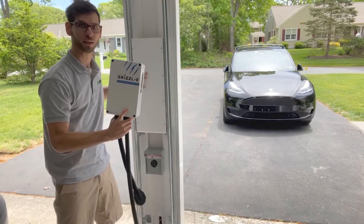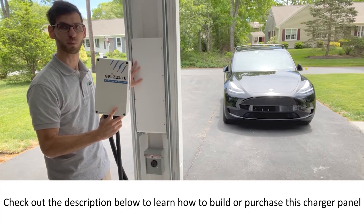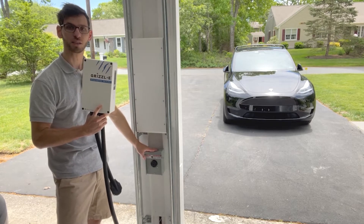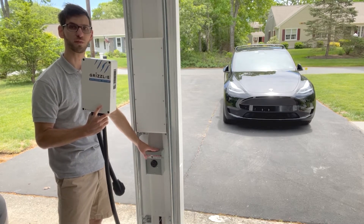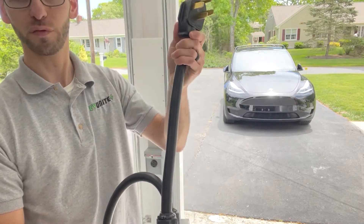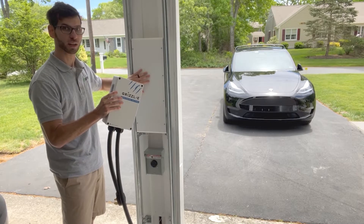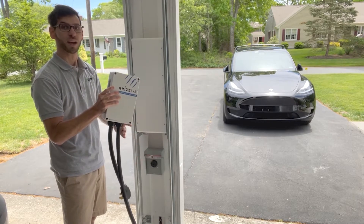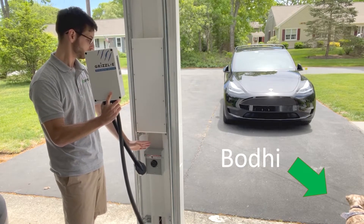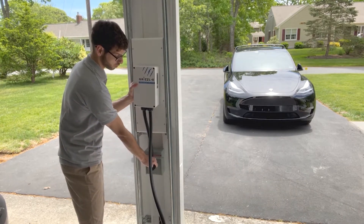You can see here this panel is just a piece of plywood with some side pieces to support it, painted white. Below it we've got our plug — this is compatible with NEMA 14-50. The cable length is only a foot and a quarter, so you want to make sure wherever you mount the charger it's in close proximity to the plug. Also make sure the plug is facing upwards, because when you mount the charger the cable comes in and you plug it in just like that.